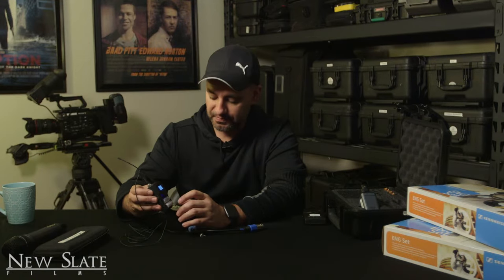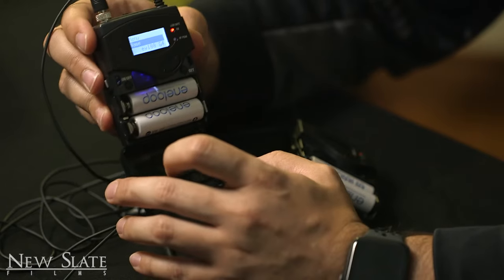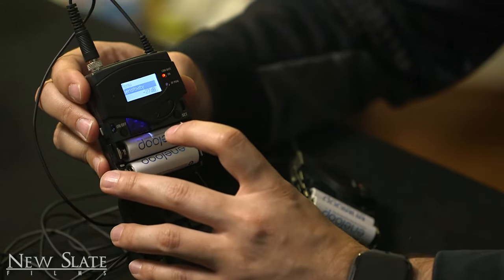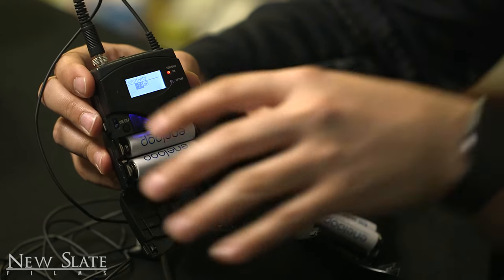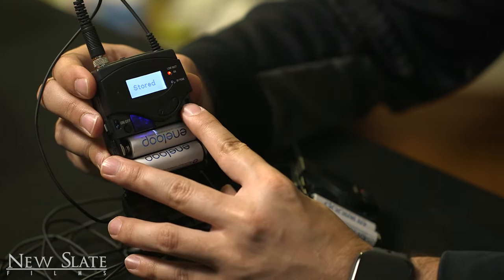So now I'm all set there. Two other things you've got to check. Make sure you do a test once you have that set up. I'm actually wearing this lav right now and it's going to the camera. Next, press SET again on your transmitter where the lav is connected and go to Sensitivity. This is a personal preference, but I like to be at about negative 27 or negative 24 dB — that really minimizes the noise around you. The higher you go, the louder the volume, but usually negative 27 is where I like to be.